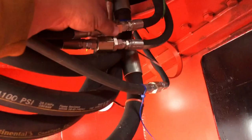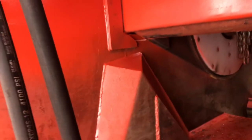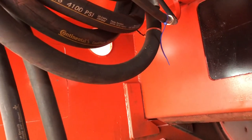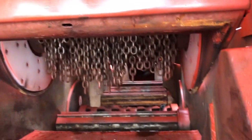We'll have swivel fittings in them. We're going to check this out before we put the yoke in — we want to see how high the yoke goes, because this has got a whole other feed wheel that hooks to these pins and has teeth on it that pulls it through. But if the yoke goes up too high it hits these, and with hundreds or thousands of cycles a day it'll blow hoses. So we might have to snug some up. The other one has two cylinders that hook right here above our heads — goes up and down. We got the yokes lifted up to put rubber in and seal everything up nice.